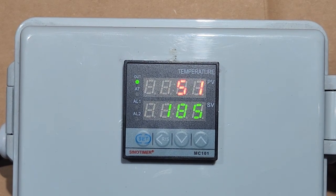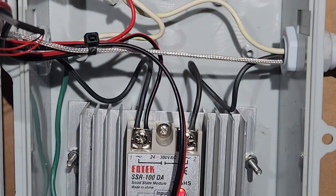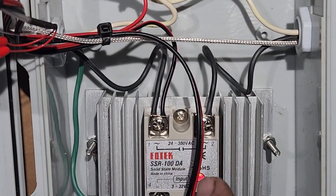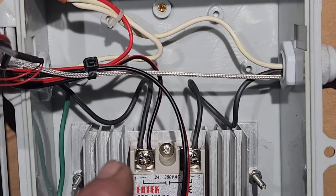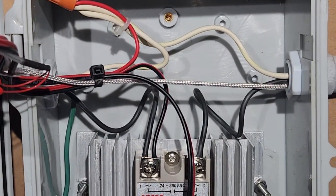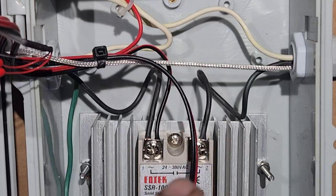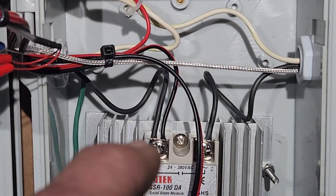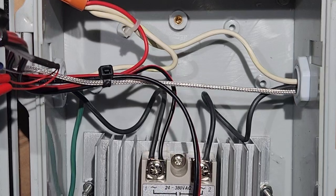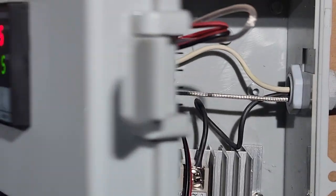This is something you don't want to do with power on, but I'll show you for demonstration purposes. There's a little red light on the solid-state relay that confirms it's receiving the signal from the PID to turn on and energize the element. If the LED on the PID is on but the red dot on the SSR is not, that means the SSR has failed. This can happen from the SSR itself failing or from the element failing — such as running it dry when not submerged, or a bad element from the factory.